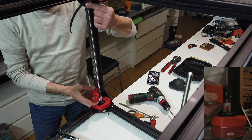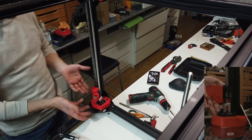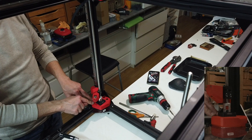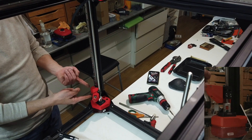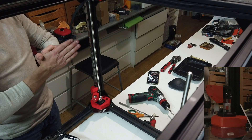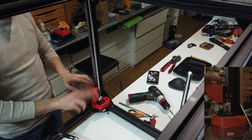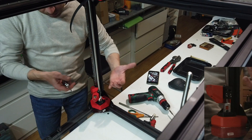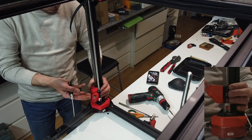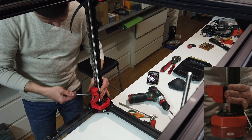As you can see on the video, the nut can move on the printed parts. So I run everything down, because the most pressure exerted in this configuration is right at the bottom position — the lowest position. As you go up, all the pressure exerted by a bent or misaligned screw gets lesser and lesser. So run everything down, and then the screw is holding the nut where it needs to go. Hold the nut and fix it in place.